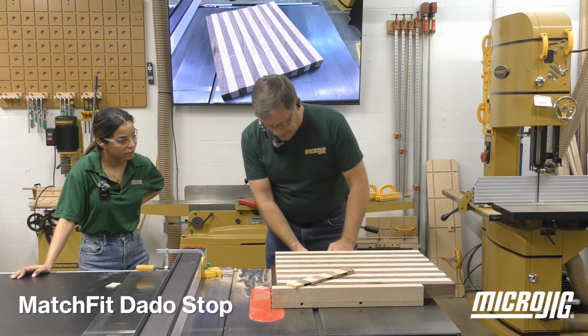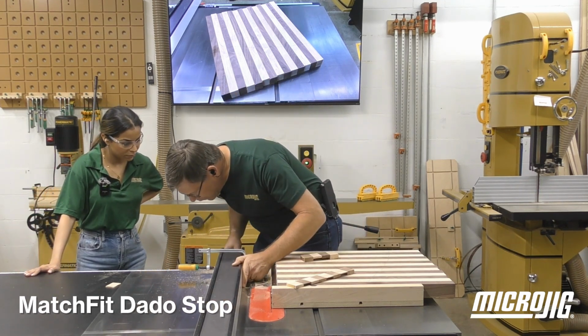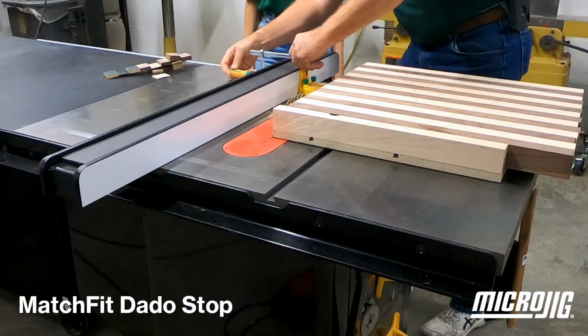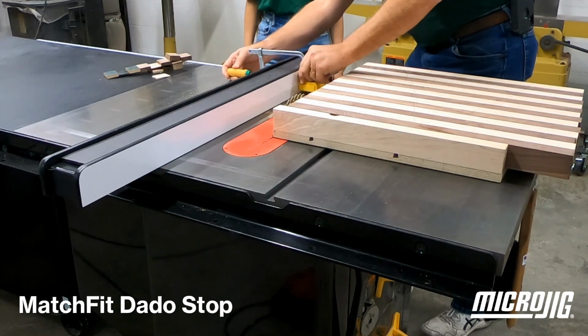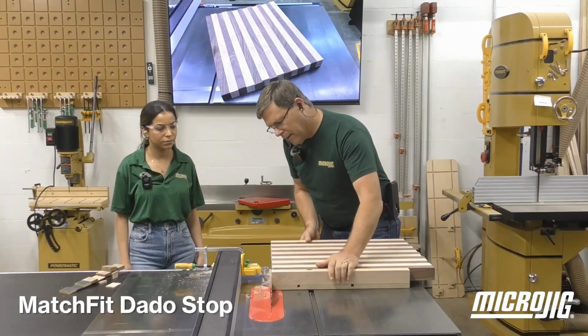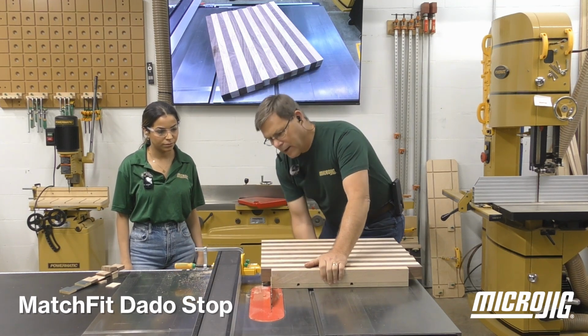We're at 1 3/8 inches here. So we're going to set to 4 3/8. We're going to bring it up because we want to make sure that when we slide our panel over, it's going to hit that. And now we'll cut that one off too.